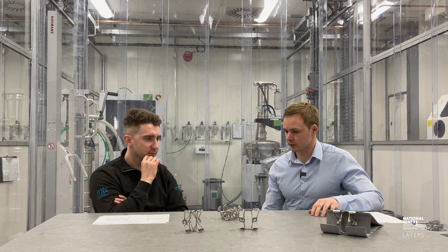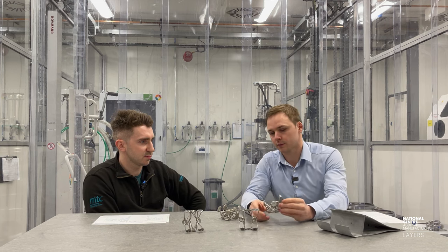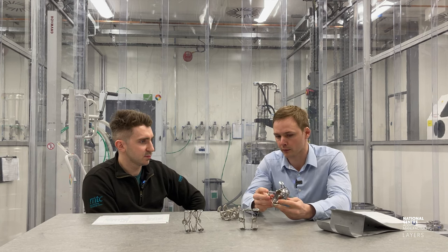To determine the best surface finishing technique, a down-selection process was carried out, testing chemical techniques, mass finishing techniques, and vibrational techniques. Eventually, mass finishing — specifically centrifugal high energy finishing (CHEF) and stream finishing — emerged as the two most suitable techniques. The material, titanium 6-4, added further challenge as it's difficult to finish in itself.